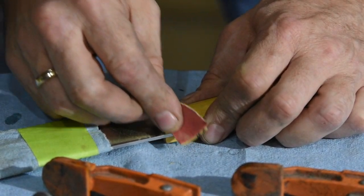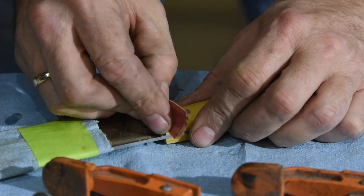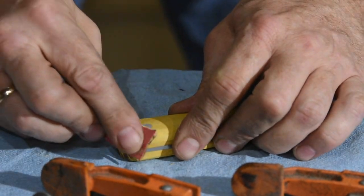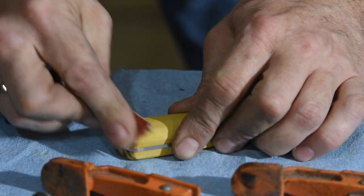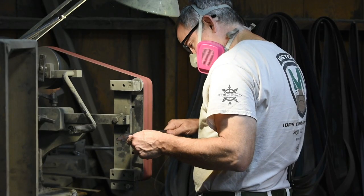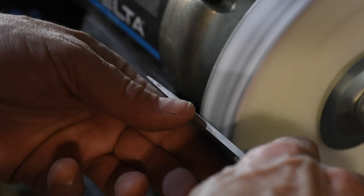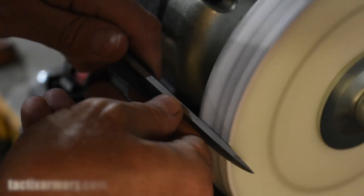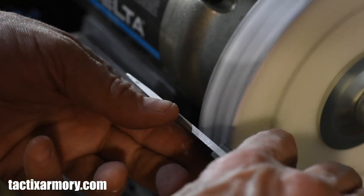Finally, I'll sharpen it. There seems to be endless interest in how to sharpen knives — there are a million ways to do it. If you're curious how I do it, typically I use my belt grinder starting at 120 or 220 grit, then moving to 320 or 400, then moving on to a stropping wheel that I show how to make in another video. If you're interested in that, here's a card.